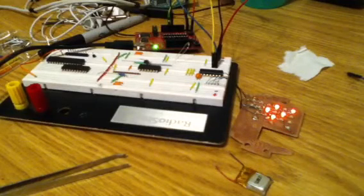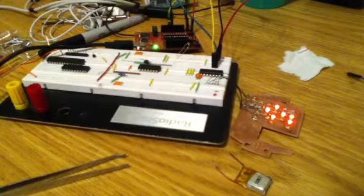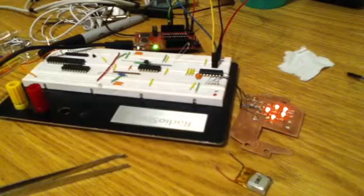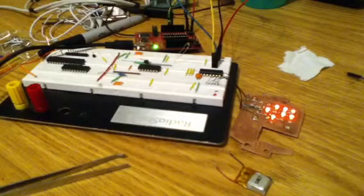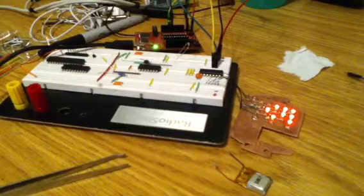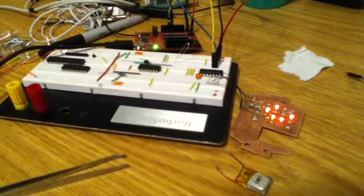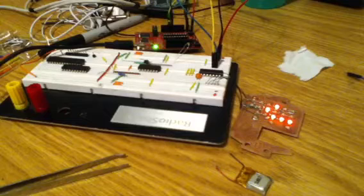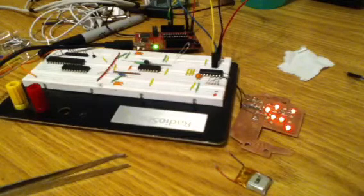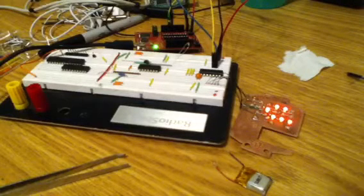So because most people don't have helicopter chargers, I mean, that's a safe assumption, I redesigned my second board to include a 3.7 volt voltage regulator to allow charging from USB, which is 5 volts, or 5.5 volts, or 6 volts, or whatever voltage your computer drives your USB ports at, probably 5 volts. From the USB standard, I've experienced ports that charge at 6 volts, which is a nuisance for certain projects, but that's not important.